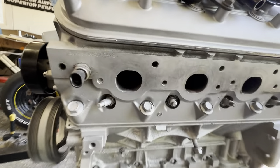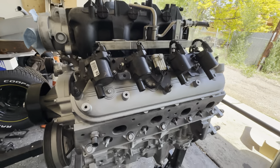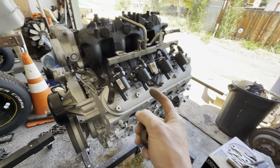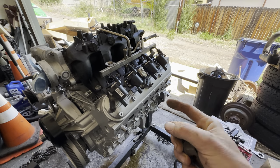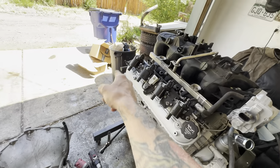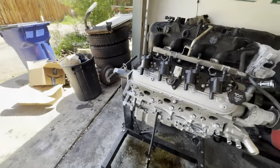On the driver's side we have a broken stud and another broken stud. On any of these truck motors, the driver's side header goes down and cuts over to the passenger side, linking up in a Y-pipe. The entire weight of the exhaust works on this side — every vibration, forever — so you're always going to have at least one of these studs broken, sometimes two, and eventually a hanger will break too. It's just the way the exhaust racks back and forth on every bump and vibration.